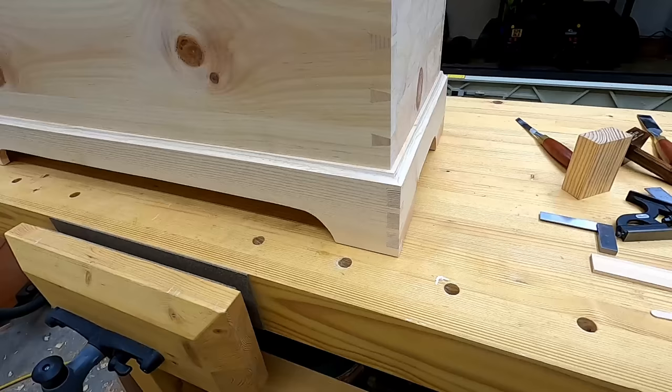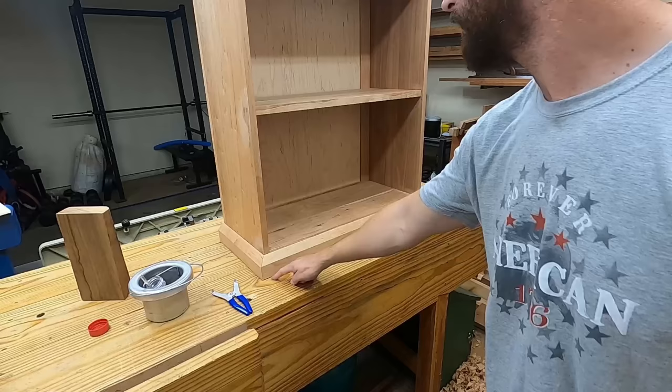How you attach it makes a huge difference. This gets messed up all the time. Check this out, guys. This is the project I'm working on, and spoiler — that base trim is not holding the chest up off the bench. Trim is trim. It's not structural. It shouldn't have a structural job. Just because it's at the base of the project does not mean that it should be supporting the project.